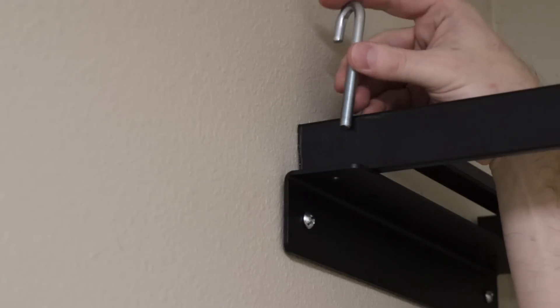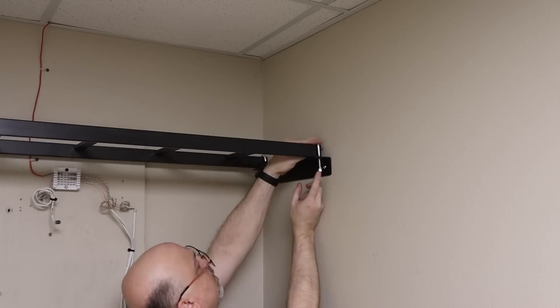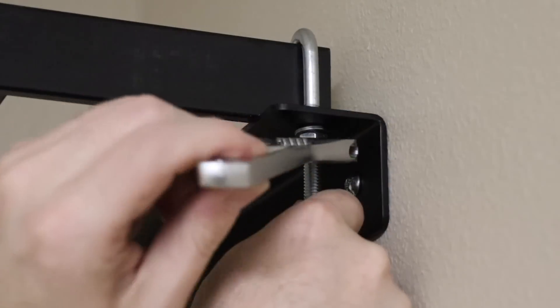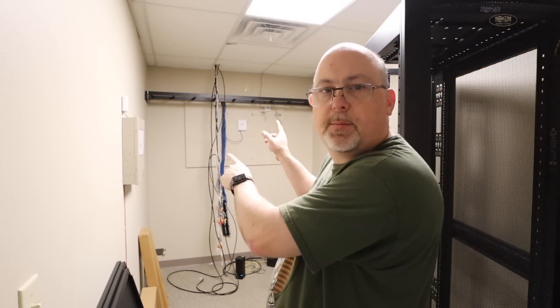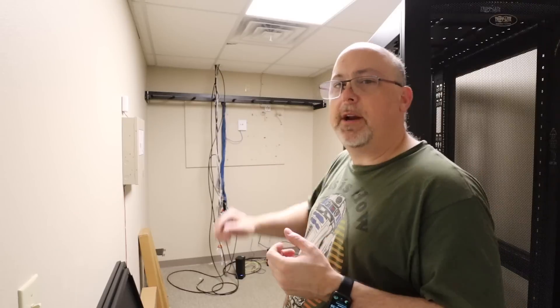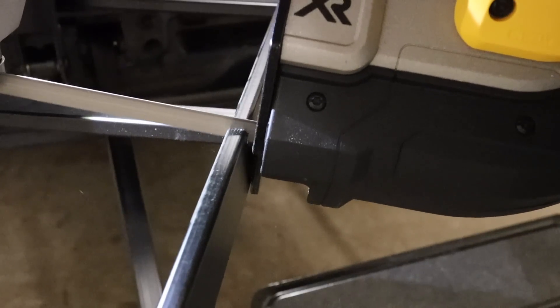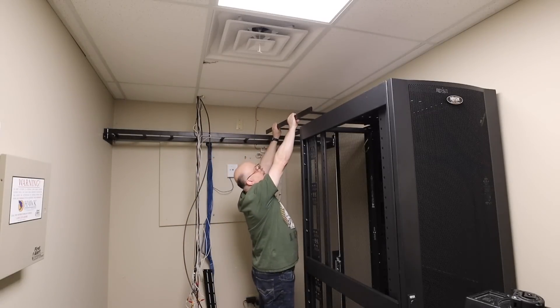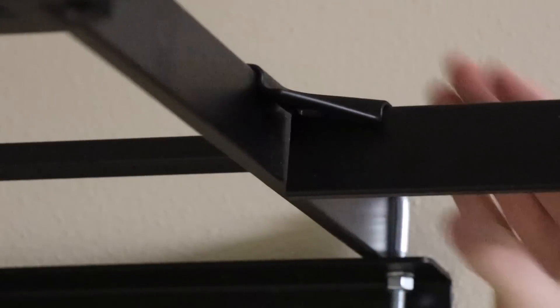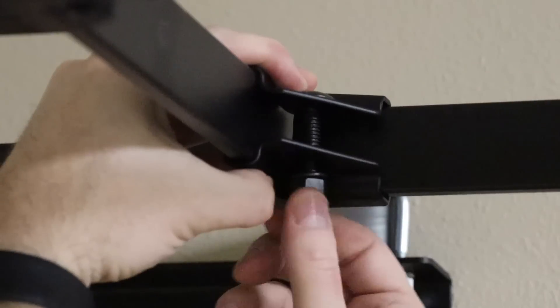Once the ladder is set atop the braces, you hold it in place permanently using J-bolts — these act sort of like little clamps. Now that we have the first piece of ladder up, I'm going to slide the rack back into the place where I want it to live permanently, and then we'll measure how long we need for the extension that comes off of the main ladder. With a quick measurement and another visit to the bandsaw, we have the pieces we need. One end will be supported by the cabinet, while the other end is attached to the first ladder using these little T-splices. It's a clamp-style design using a bolt to squeeze the two halves together, making for a quite sturdy bond.